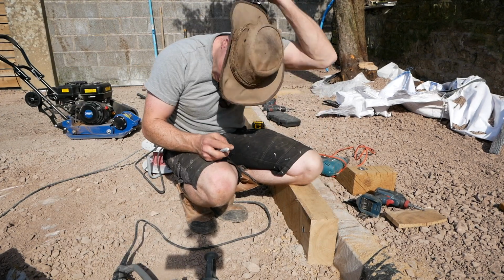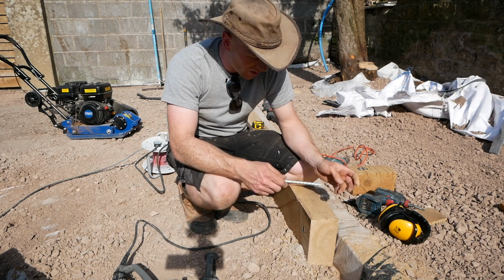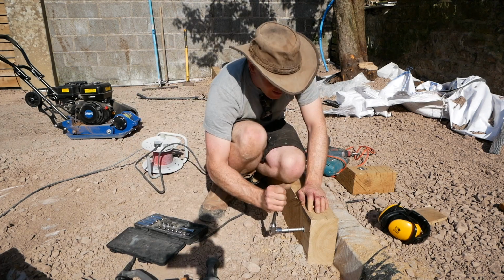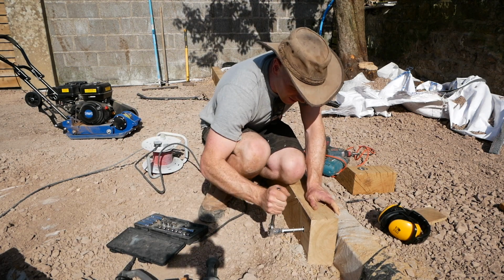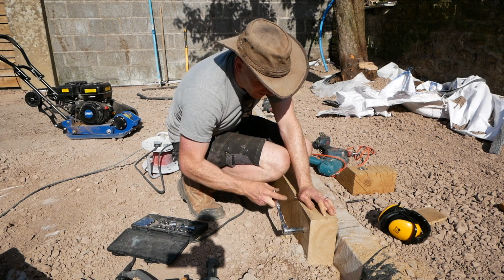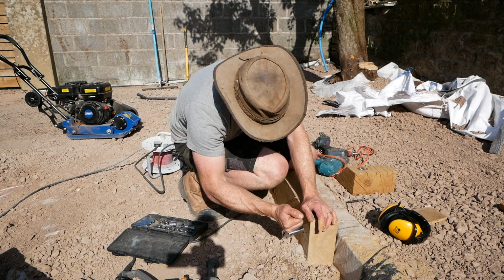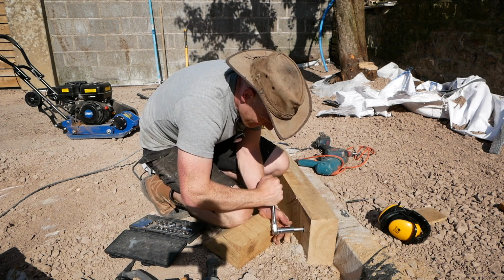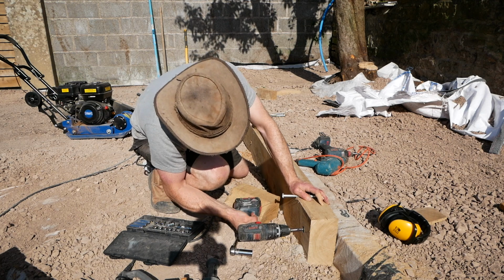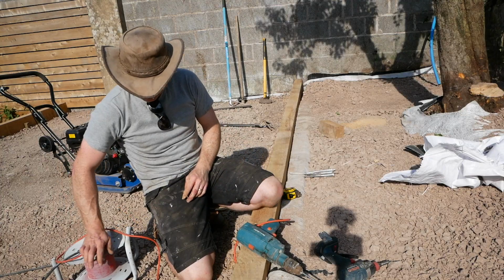If you were doing this in a really thorough way, then I would suggest using, like we did on the porch, stainless steel fixings epoxied into the wall or concrete that you're going into. But this should do the job. Let's find a socket. And you'd also want to be blowing out the hole or vacuuming it out to get rid of all the dust. Now I know the 25mm hole takes a socket, but if your hole isn't right in the middle, that ain't gonna go. Well, third time lucky, they managed to fit in and managed to get the socket inside that hole too.